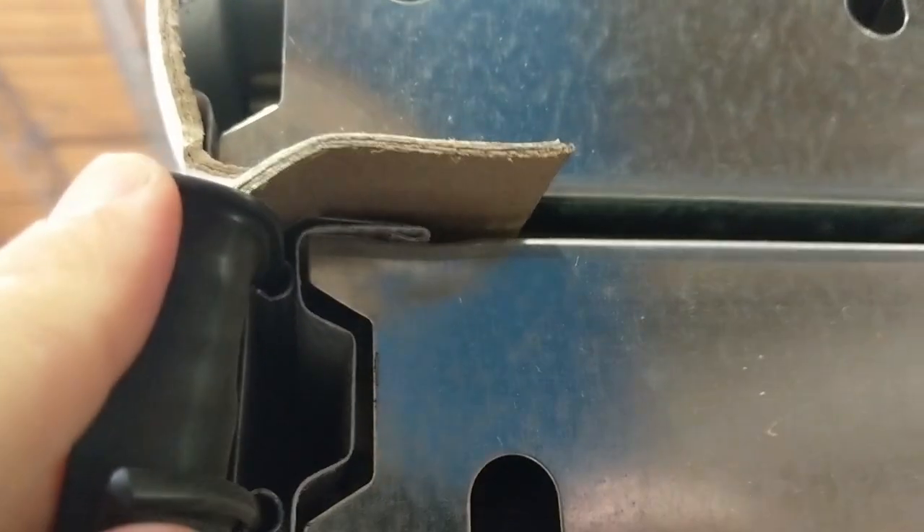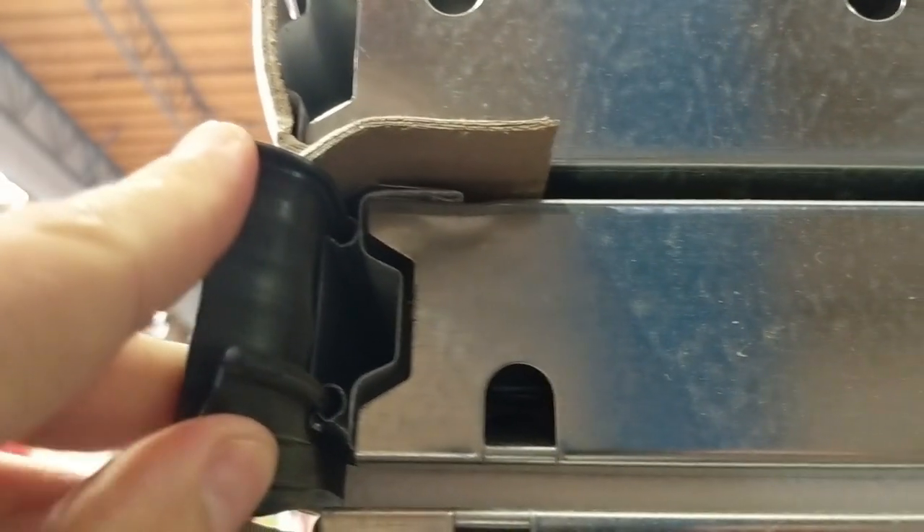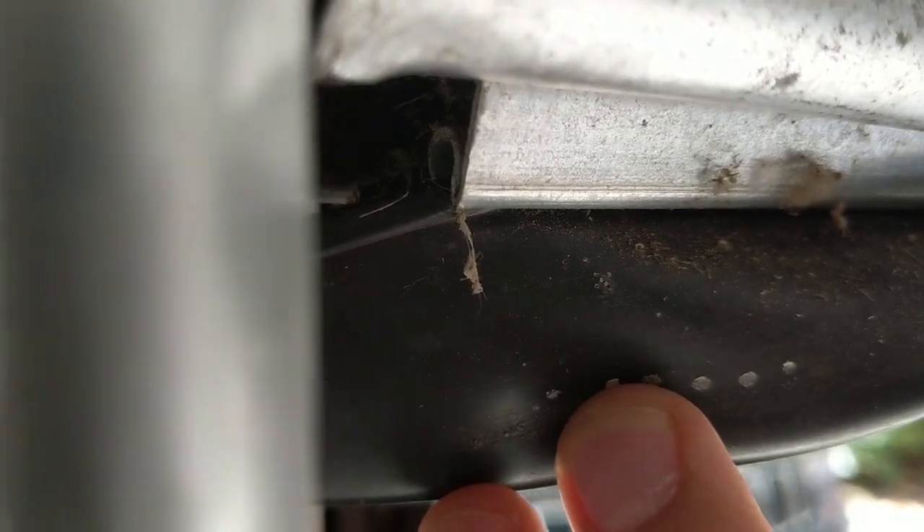Now it's important to understand that this seal has a specific groove and it's not like the T-channel groove that we've featured before on this channel. It's almost like a bubble groove — a little circular groove — because the bottom retainer for the 8000 series and the 9100-9605 has a specific channel shape. So if you buy a T-channel bottom weather seal, it's not going to work for your Wayne Dalton garage door. You want to go with the official Wayne Dalton bottom weather seal to fit your specific garage door needs.